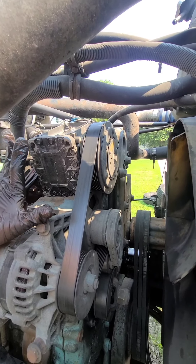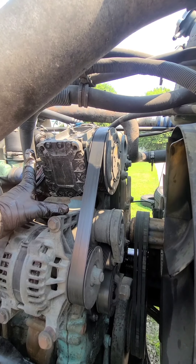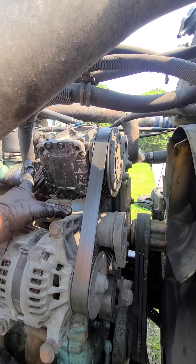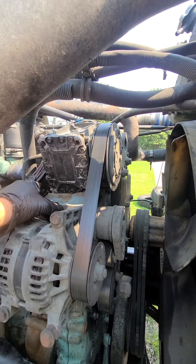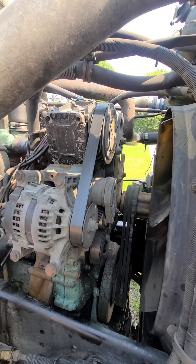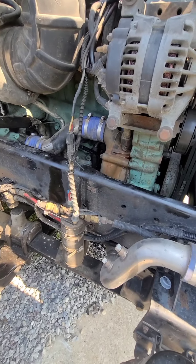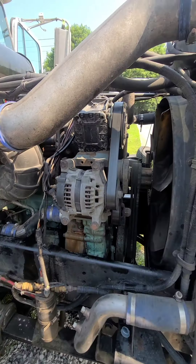This is why I don't really like going behind people's work, especially when it comes to AC. I usually tell people if I'm going behind someone and it's messed up and not an easy fix, I'm replacing the whole system — vacuum it out, flush it out, do everything, start over. But with this, since I can't get the dryer, I'm stuck. The customer maybe just wants me to replace the compressor and see what happens, but it's most likely going to leak again.